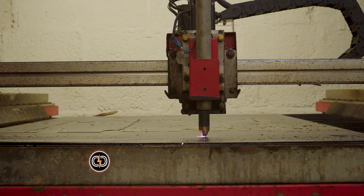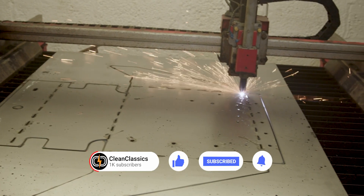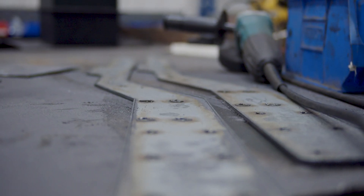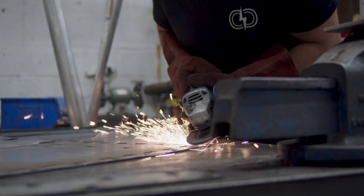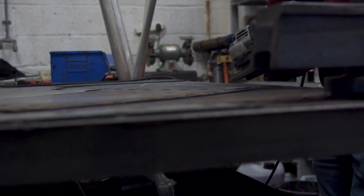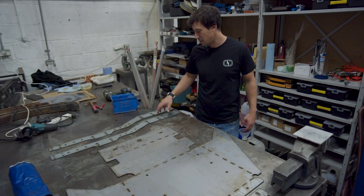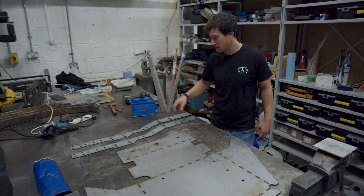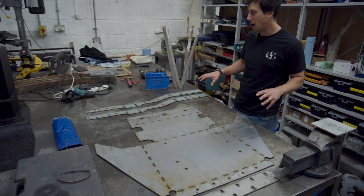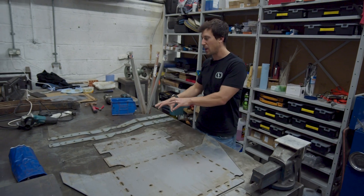This is where the guys at Hastinley Garage come in. We get some metal in, pop around the corner and try our stuff out. This part here is actually going to be a final part, but these parts here we're checking some profiles. Making it in metal means that — as opposed to doing it in paper or card — you can't warp it to suit your will, it has to go in where it goes. We'll line these up, bolt them into the mount points, and check everything's in the right place. We've done it in a thinner steel to start with, just as a mock-up, because it's very difficult to get all of the positions exactly right when you're getting quite close to stuff, so mocking it out like this is really sensible.